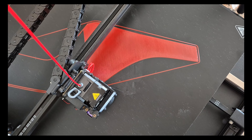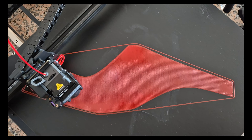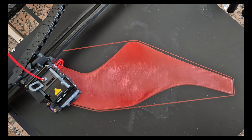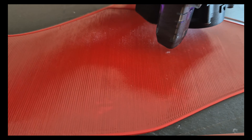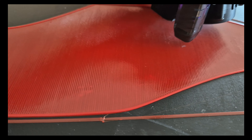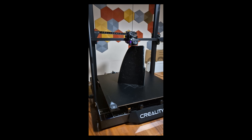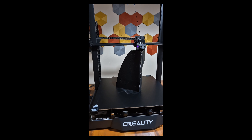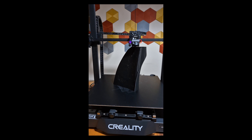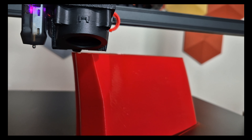The parts are spread over wide surfaces, which gave me an idea about the leveling system — one of the biggest problems with printers that have a large printing area. However, the device's sturdy metal body and dual linear rail keep the printing plate extremely stable. The CR Touch system gave very good results, and I did not encounter bed leveling problems. The first layer turned out nice. I was also wondering if there would be a swing coming towards the top, but I didn't encounter any problems on either the top or bottom surfaces.